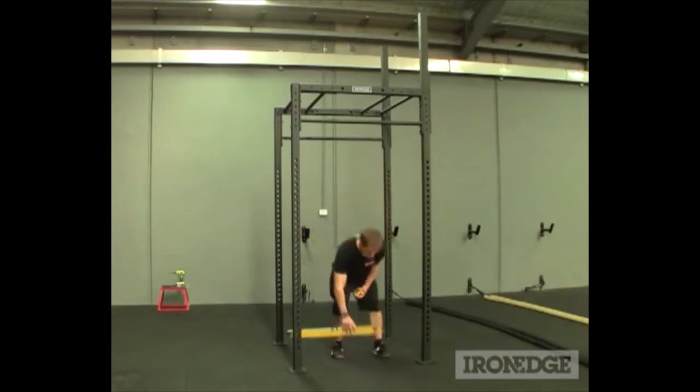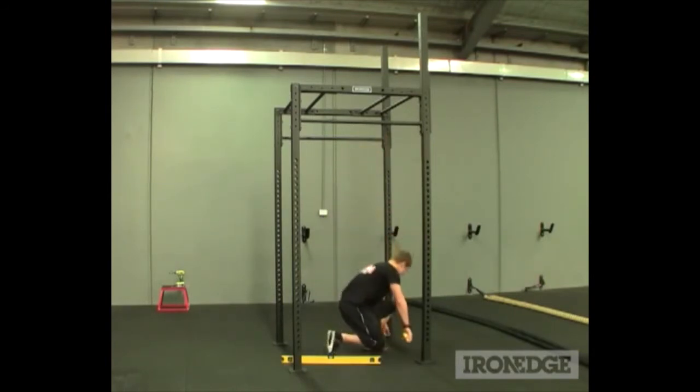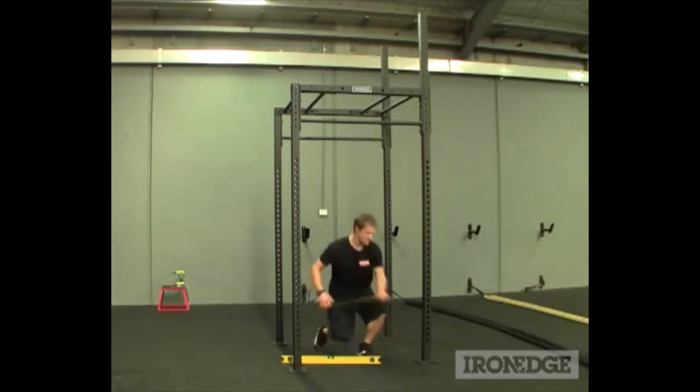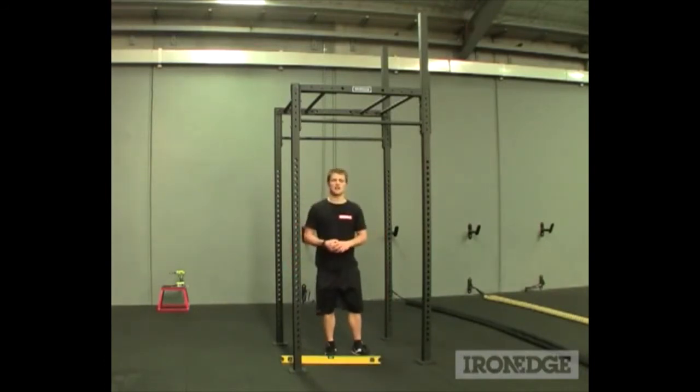Then the next step is you want to make sure that the distance, which is 1080 millimetres, is the same at the bottom. So you want to use your tape measure to make sure that all of those legs are the same distance. So you're just going around, then you're ready to actually dynabolt this thing to the ground.